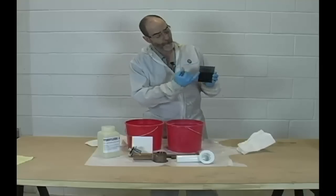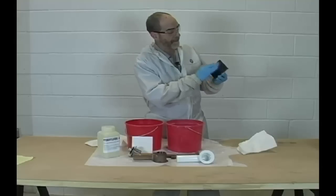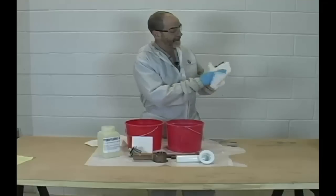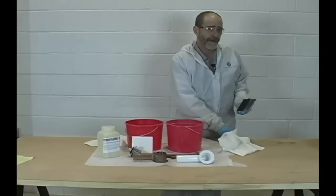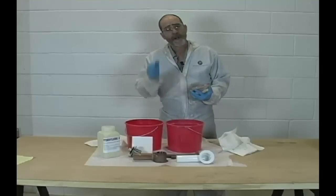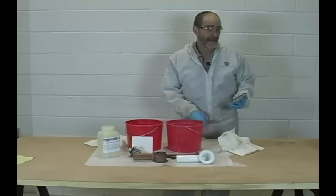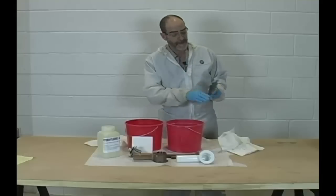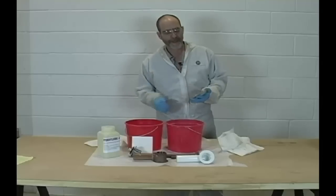You can see this white material forming up. Once the tub has been etched, rinsed several times, and dried, we basically go over it with a sander and the powder gets removed. Once it's removed with the sander, we go over it with a scuff pad, rinse, and clean again. What you now have is an etched surface. You wouldn't have your car painted without having it scuffed and sanded — you wouldn't re-varnish your furniture without having it scuffed and sanded. When we're doing tub and tile, our tape often peels the paint off — that's the fault of whoever painted the room and skipped this important prep step. It's just important that all loose powder is removed prior to refinishing, but now you have something for the coating to grab onto — mechanical adhesion.